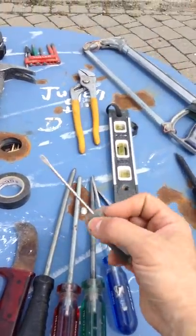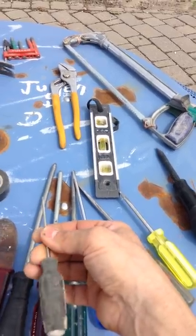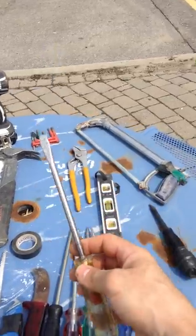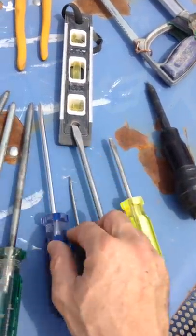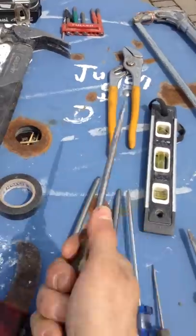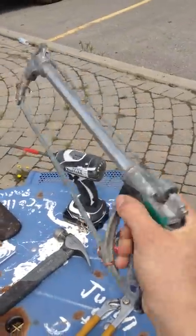There's also a mini screwdriver for finer work and low-voltage applications like hooking up furnaces, thermostats, and dimmers. You want a large, medium, and small flat — three or four different sizes. One of them should be sturdy enough to use as a chisel when you need to stab something out or remove something that was previously installed incorrectly.